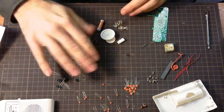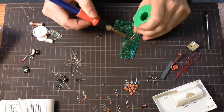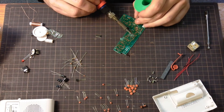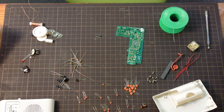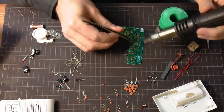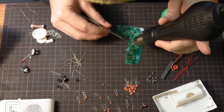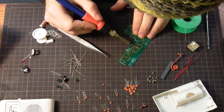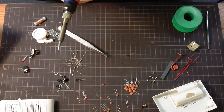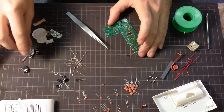First we're going to work with the SMD component. I'll just put a little solder on the pads and then use some hot air to actually attach the chip. I find the hot air is a little bit better, a little more clean, but even still I want to kind of clean up my traces afterwards.